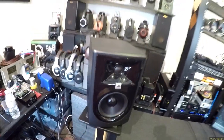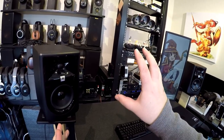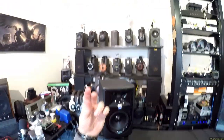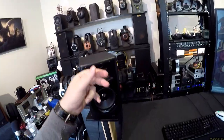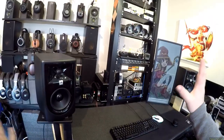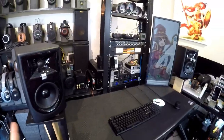Now let's listen. You definitely hear that, right? It's there. There is a shh. Let me see if it goes away, hold on. Yeah, taking the volume from full 10 down to 0.5, that is a consistent buzz until you go to zero, and then it's off. So it's not as much an amplifier ring, like it's just waiting to go, as it is just noisy amplification. And that's really the only limitation of these.